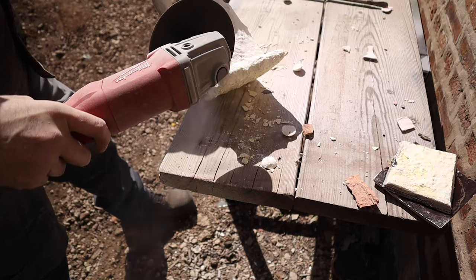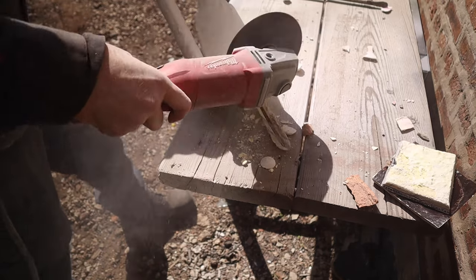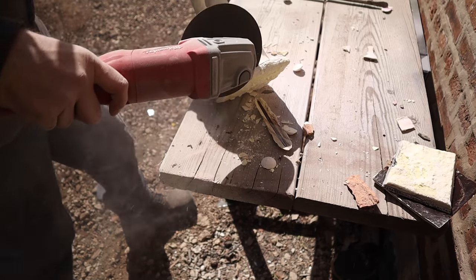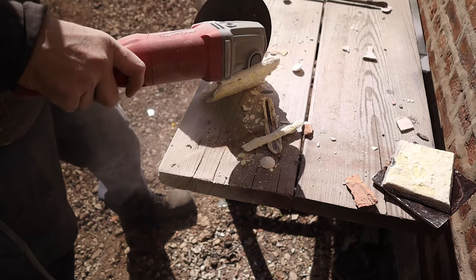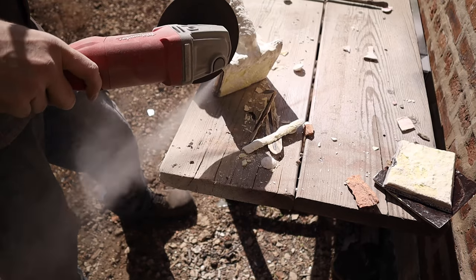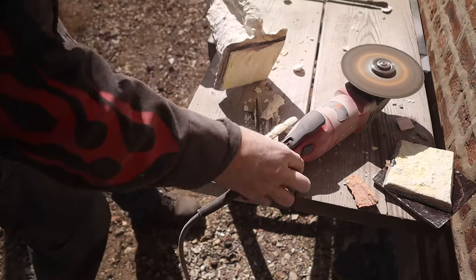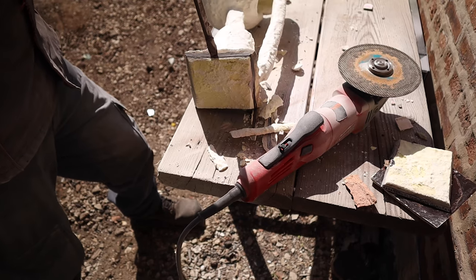And so I want to maintain as much of that surface area as possible, so it's just easier for them to balance. So what I'm going to do is actually use the cutoff wheel on my grinder and slice off just the edge of the cardboard until I reveal the waxy cardboard underneath, and then spin it around, make another cut, spin it around until I hit all four sides. And then I'll use a little pry bar or an old screwdriver and plunge it into that wax division between the ceramic shell, and with just a little bit of pressure, I can pop off that lid,